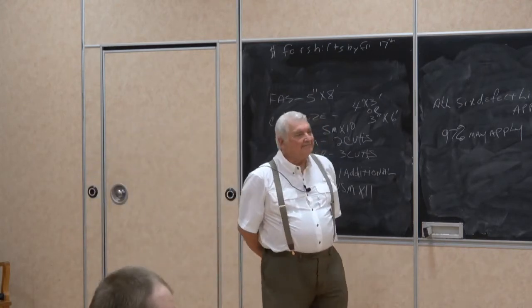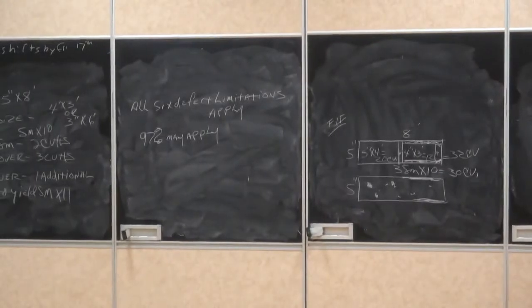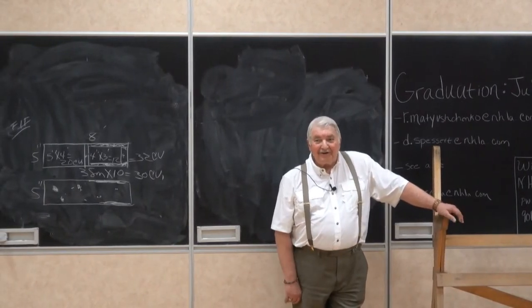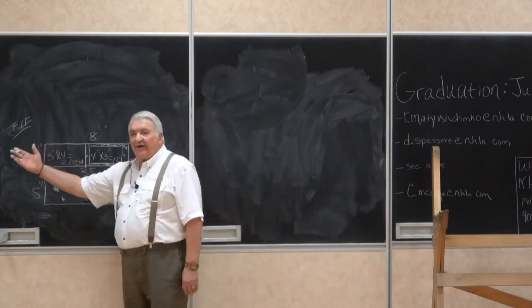Rich, I want to tell you one thing from my experience grading claims: the biggest thing people do wrong on 8 foot and longer is they forget about one-third the knot size. They'll take their nice two cuttings, plenty of yield, but the knot in the middle of the board will be a 4 inch knot, because walnut has a lot of push-in. Another issue is the saddleback wane in the middle of the board, and they'll call it a one common. I'm like, no, sir. That's because they don't know their wane limitation for FAS. We do buy almost all of our walnut from Amish. And here again, all six defect limitations apply.